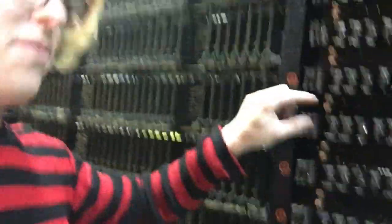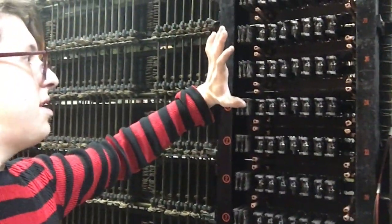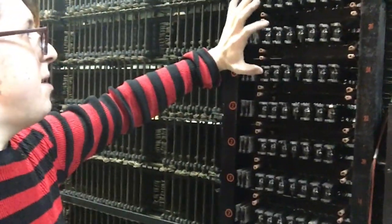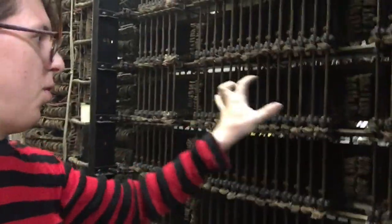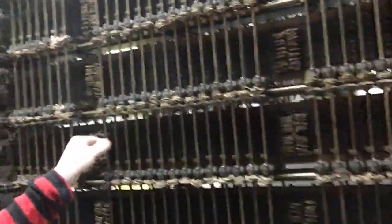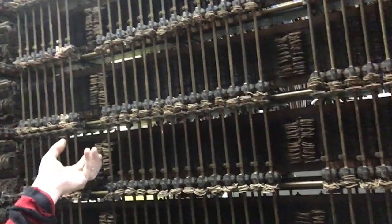I don't know what it is yet, but if there's a problem in this preference chain, it will get stuck. And this preference chain, I know for a fact, has been defeated because it needs to be partially defeated in order to only use some of these selectors. If one of these make-busy things was pulled out and the relay was once again activated, it would try to use one of these selectors, which isn't powered, and it would then get stuck there.